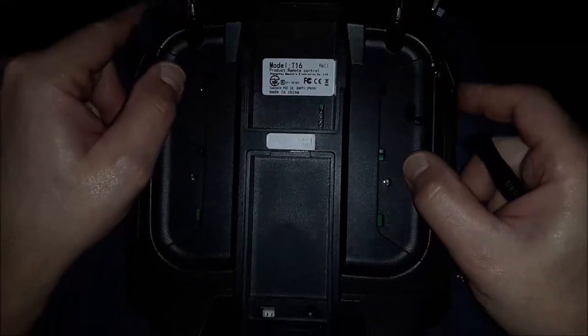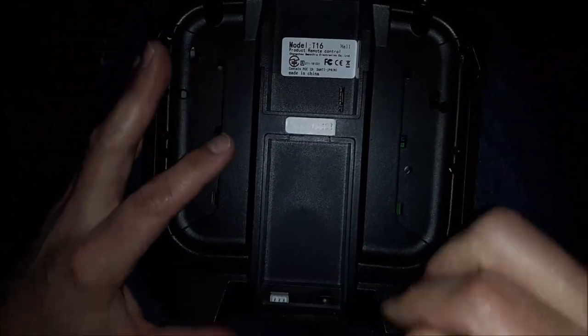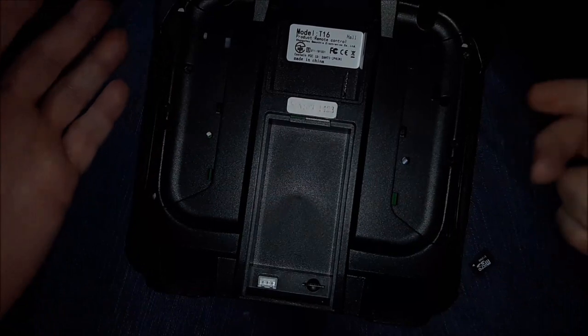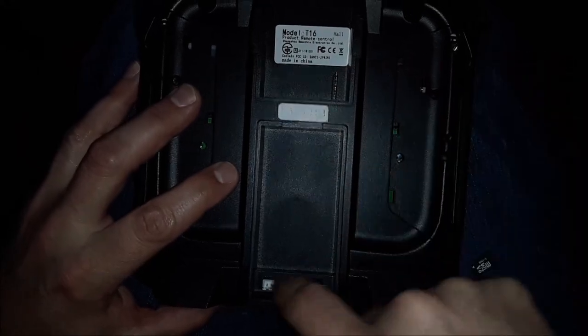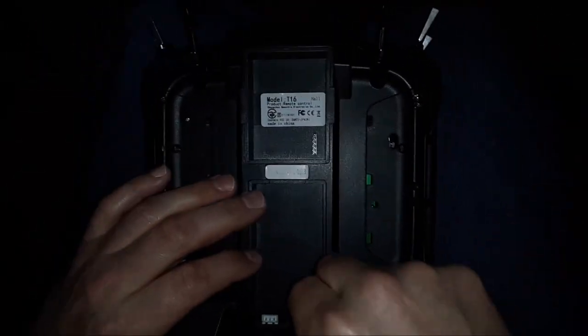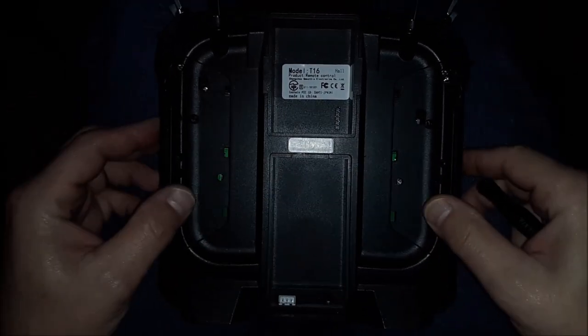Put it forward, make sure those pins don't bend, then wiggle this board into place. See how it just fell flat? You have to line that board up so the pins seat correctly. Once the case is closed it's tight all the way around.